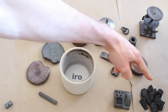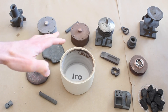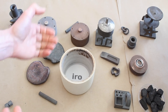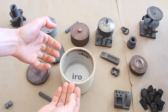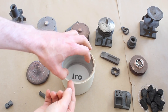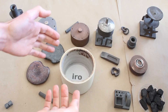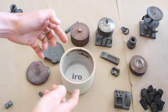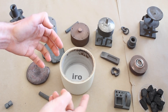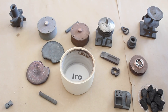If you wonder why we need coke: coke works as a sacrificial material. It reacts with oxygen. There is a small crack between the crucible and the lid, so a little bit of air is coming in. If we just let it in and did nothing about it, it would oxidize the metal. So if we put coke, it reacts with oxygen and the metal is not oxidized.